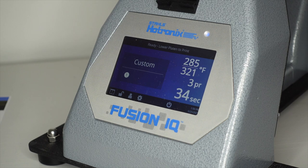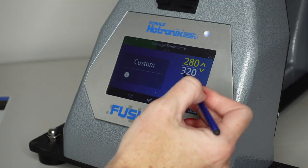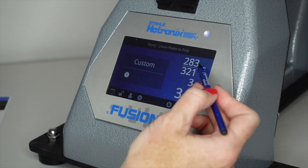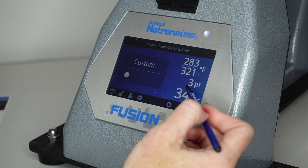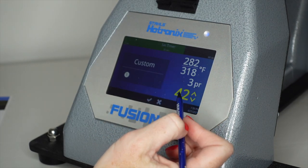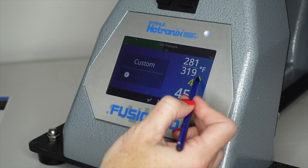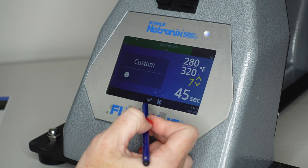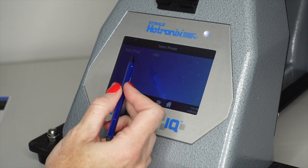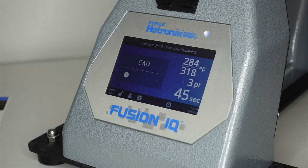The easy way to go ahead and change everything is to just tap on what we want to change. My temperature should be at 280, and the bottom temperature should be at 320. We are getting just a little bit of variation on this, but it's only a couple of degrees. We want to make sure our pressure readout is accurate, and of course our time. We are just going to tap this bar or the arrows to adjust to 45 seconds. Check that box. For the pressure, this is just a gauge to tell you what you want to be at in terms of readout for the accurate recipe. You can also go into your settings and select the correct transfer and it will automatically do the adjusting, except for the pressure — the pressure will still need to be adjusted.